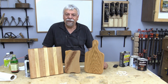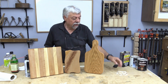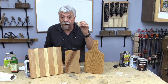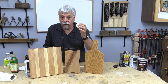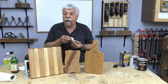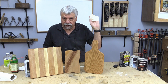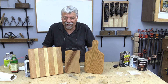Well, that concludes our video on cutting board finishes. And before I go away, I want to talk about oily rags. I just want to remind you, I think a lot of you already know, we never bunch up oily rags and throw them in the garbage or throw them anywhere. You always want to make sure that they're unfolded, leave them outside somewhere, preferably on something like a rock. Let them dry out for a few weeks before you throw them out, because we don't want these starting fires in our workshop. That just is a bad day all around.